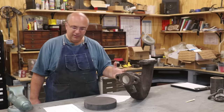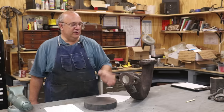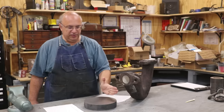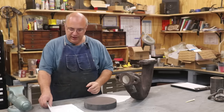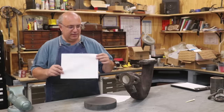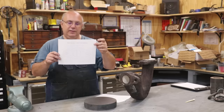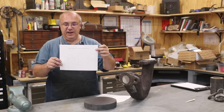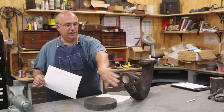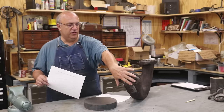So here's the game plan — just cut to the chase. We're going to lop the whole flange off the end of this. I'm going to take a bandsaw, cut this whole thing off, and fabricate a new flange. I've got a drawing to replace it using basically the same design as the original. We're going to fabricate and machine a totally new flange, and then reposition the whole new flange on here.